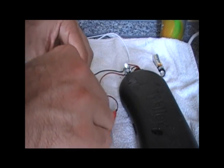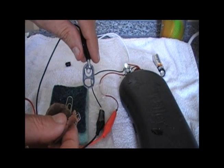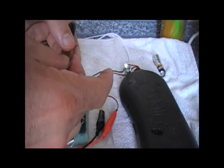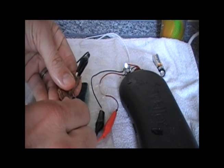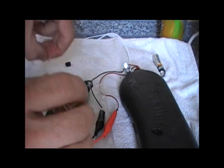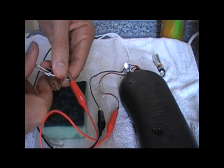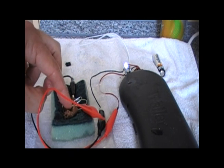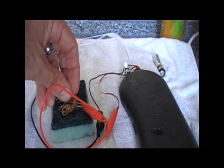Again, we can see if we take it apart what this is made of. The battery here is just a tab of a soda can for the anode, and then we wrap it in a towel, and then we put the paper clips on it. The more paper clips we put, the more surface area, and so we get a brighter glowing LED.